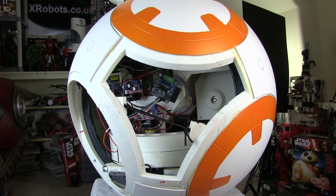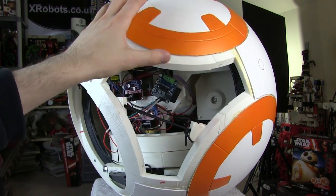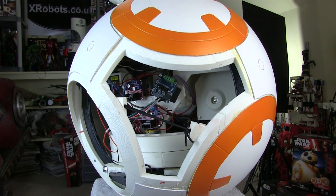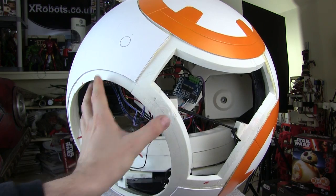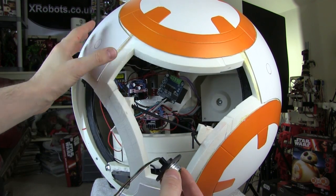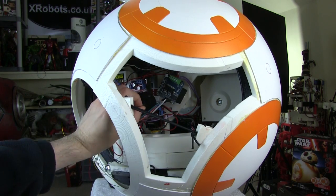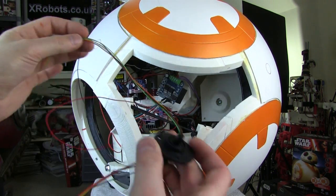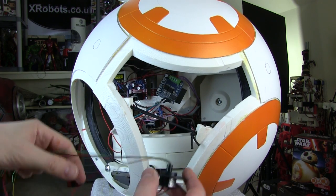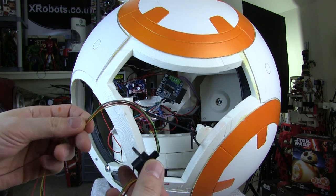Because this really runs in a single axis and turns to steer, I've always been in a situation where my panels always overlap the outside somewhere, so the droid never drives sideways, and that means I can always get to the inside of all of the panels at all times. The plan is to put LEDs in there, and the big panel that removes from here will have opening arms, so I need to get some power to that and some data for servos and the LEDs. I'm going to do that with slip rings because obviously the outside always turns against the inner hub as it goes along. I need to mount a slip ring about the pivot point, then take these wires to the outside for the LEDs in these panels. I need a six-wire connector — enough there for power, data for NeoPixels or RGB LEDs, and also for servos.